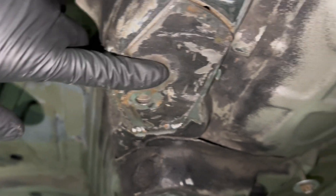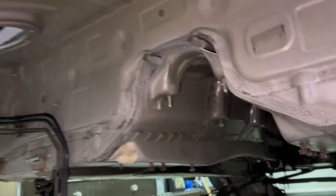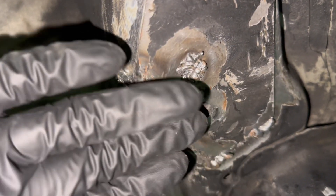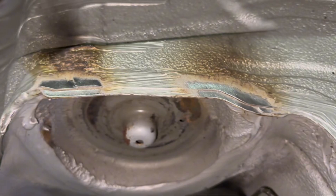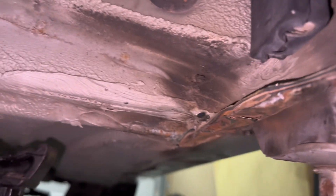Since this time I'm going all in — I'm still nervous because this car is at the point where I'm not sure I'll ever get it back together — but I'm also fixing a spot I messed up where the bushing seat needs to be completely flat. I didn't do that last time so I'm correcting it now. We'll also finish welding a couple other spots that were cracking, like these ultra-sketchy jack points.